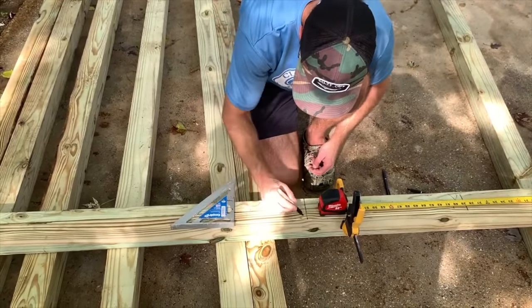The last few steps in the shed window installation process is to complete the finishing touches. That is, installing caulk on the top and sides of the window trim. I don't recommend that you install caulk at the bottom in case any water gets entrapped, it's able to drain out. And I also recommend that you use caulk between the bottom window trim and the window flange to prevent water from infiltrating in between the two. Then perform any touch-up painting as needed.